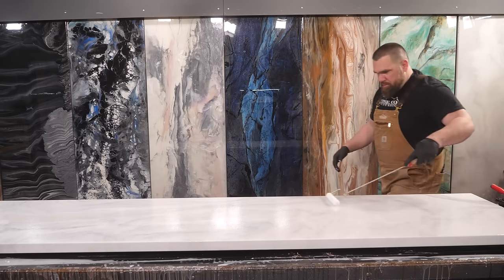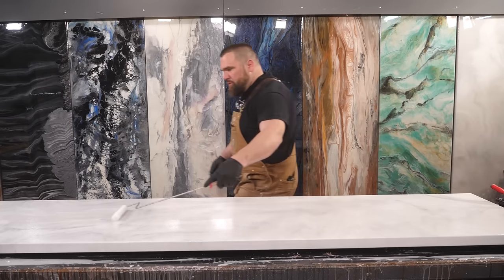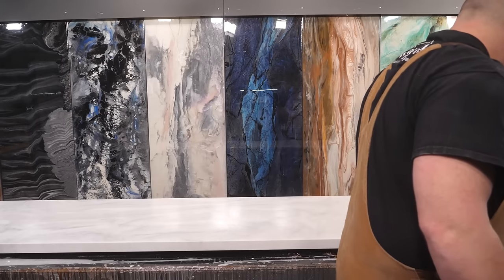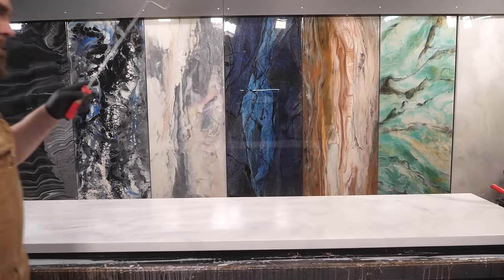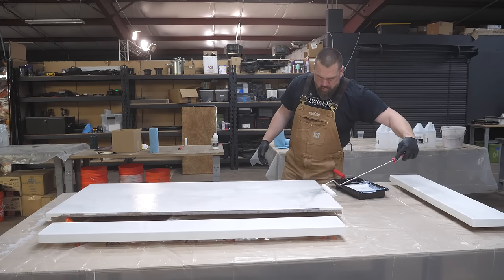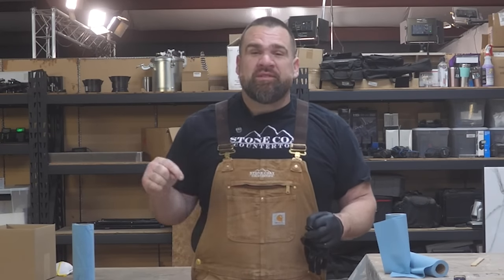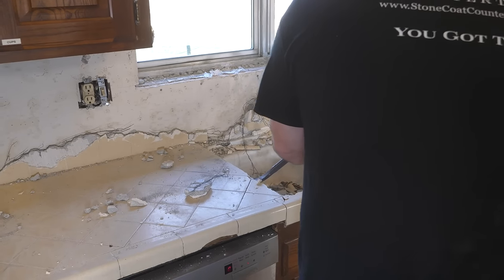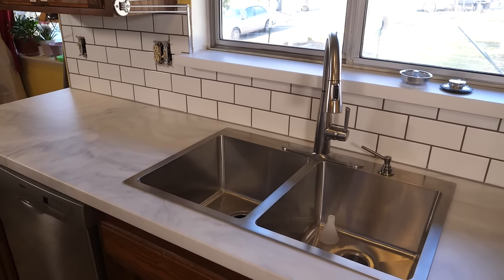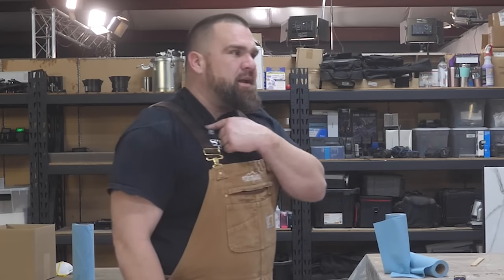Now using a fresh, clean, de-linted dry roller, we're going to remove some material off this top. Barely any pressure — I'm just letting this roller glide right across the surface, keeping pressure towards the elbow of the roller, going back and forth. One more dry roller going the same direction the whole way, picking it up and going about halfway over. Barely feathering it — real gentle. That's looking sick. I'm going to let this dry and we'll be ready to install tomorrow. We're heading on-site to demo some tile, rip out the tile backsplash, cut out the sink, and install the same day.